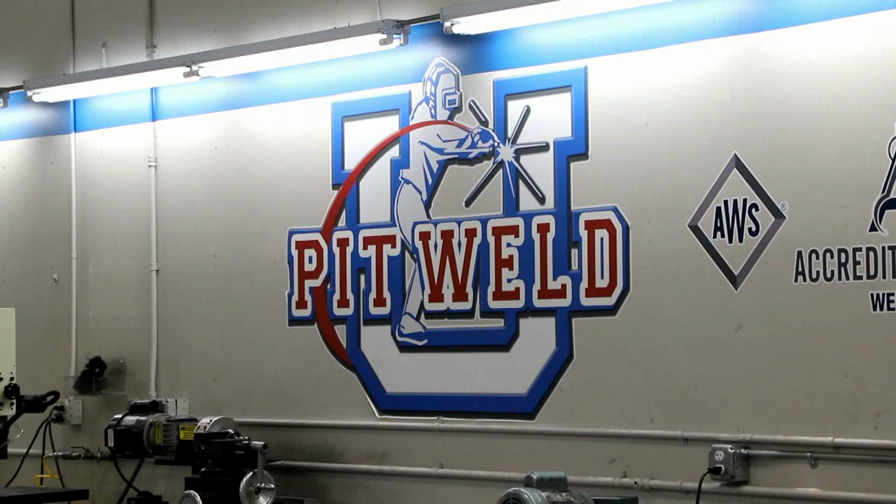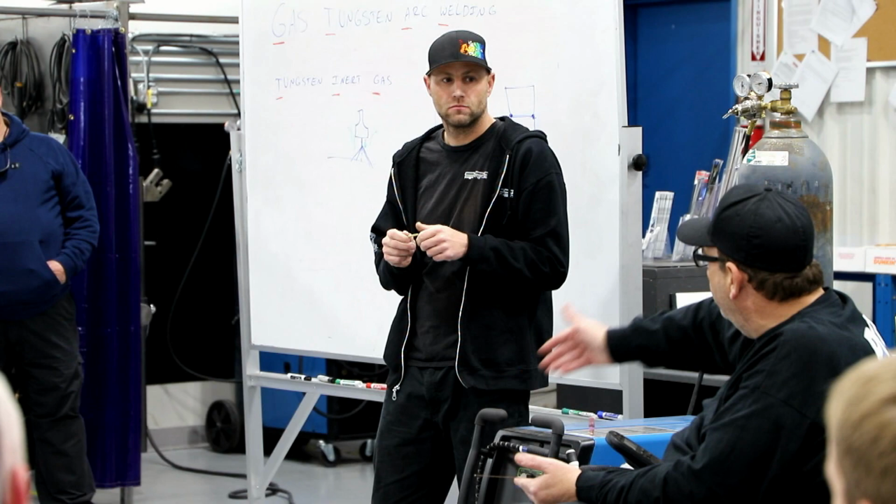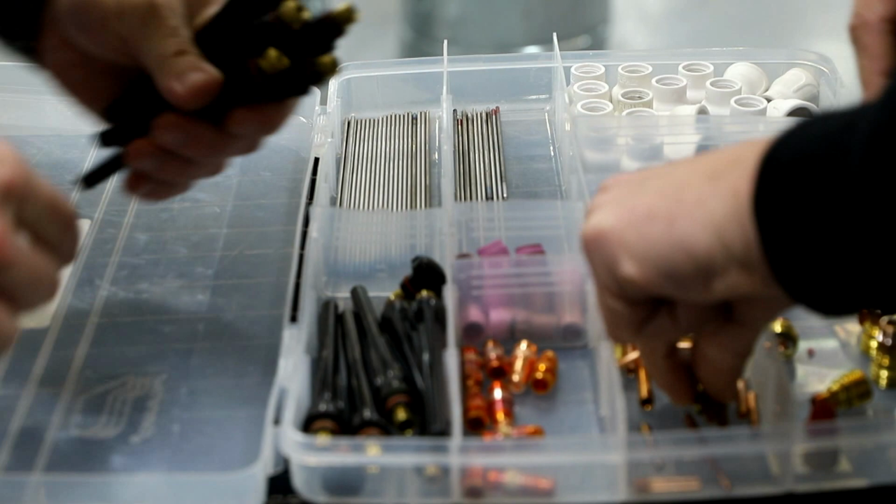Stack of dimes. That's a great weld, it's a good weld. They'll give me a piece of copper, I'll make you one with a MIG and we'll knock it off on the floor. It's not a great weld. We've got to make sure we fill it, get it to wet in at the toes, and we'll show you all about that later.